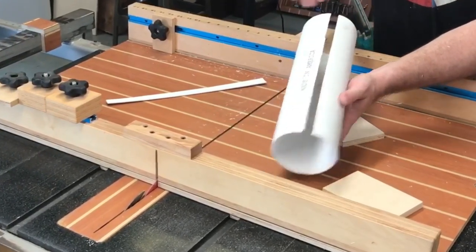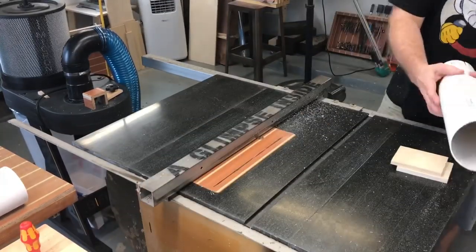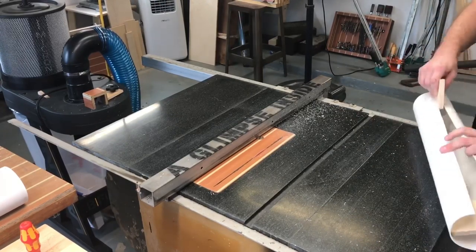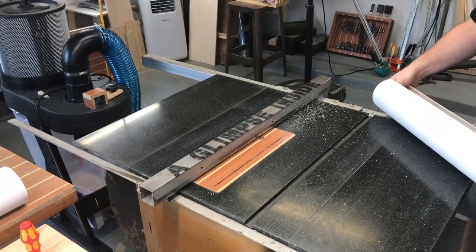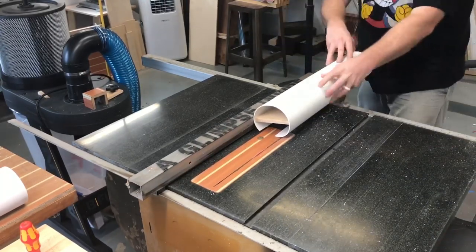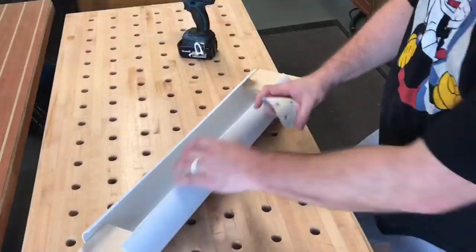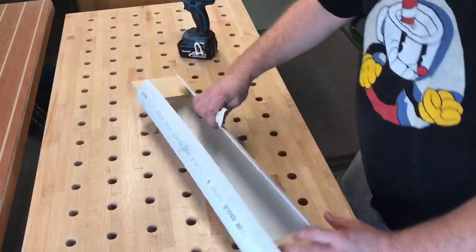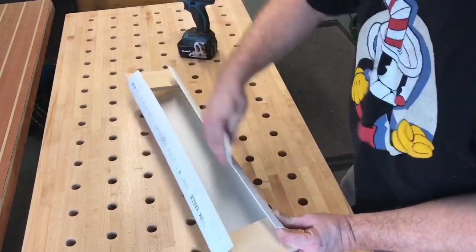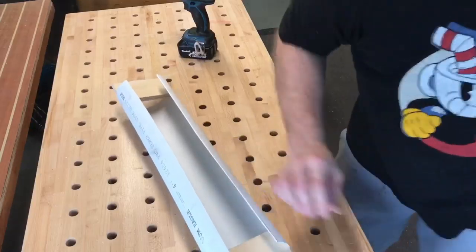As you can see, we've got the space we need. The next rip cut is without the crosscut sled due to the fact it just won't fit. But you can do this with the fence in place — same process as before. Put the blocks in place and move the fence over by 3/4 of an inch, and rip off the piece you need to make that gap that the paper is actually going to come through when it's finally installed. At this point I've got some 100-grit sandpaper and I've left those spacer blocks in place because I'm going to sand the edges of the PVC — they can be very sharp after cutting.